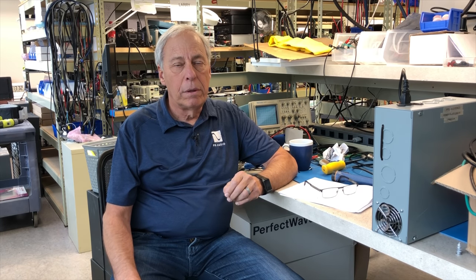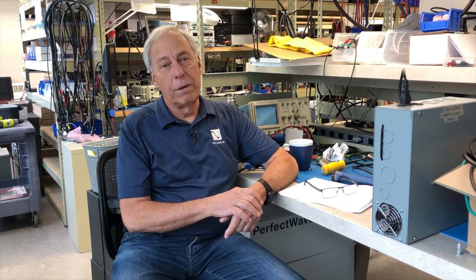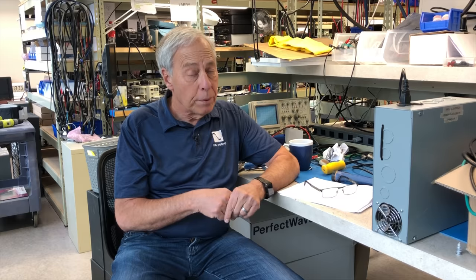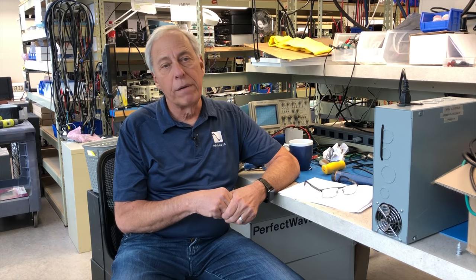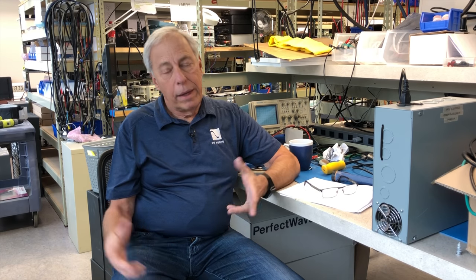Having said that, I have never found a pair of passive speakers, ones that you just hook up to a power amplifier and let her rip, that goes down to 20 hertz. Never seen a pair of those. Maybe they exist. I know a lot of manufacturers will say, oh yeah, these are 20 hertz capable. Let's just say their 3 dB down point is 20 hertz, which is pretty respectable. If that were true, then you wouldn't need a subwoofer. I just have never seen it. I've seen a lot of manufacturers saying that they do when they poke a microphone 1 meter away from the speaker, but actually at your listening position, it's pretty rare. And again, I've never seen it happen.